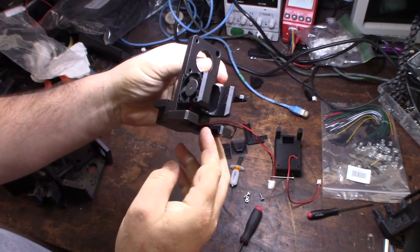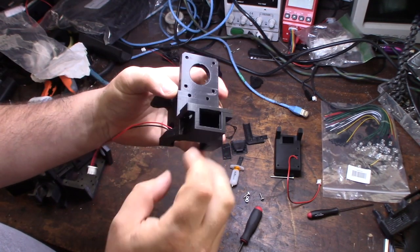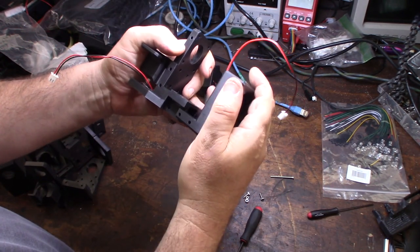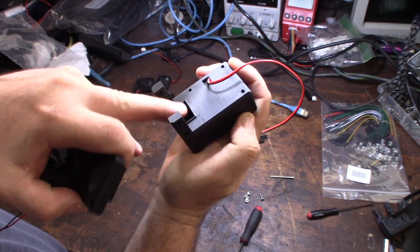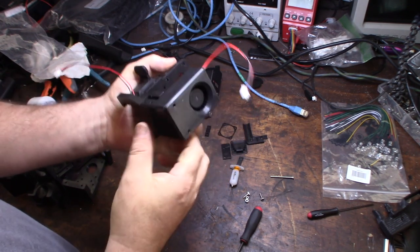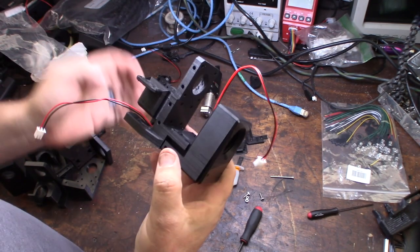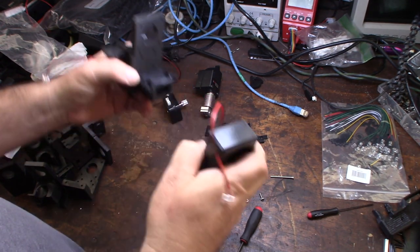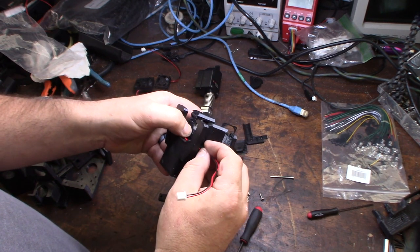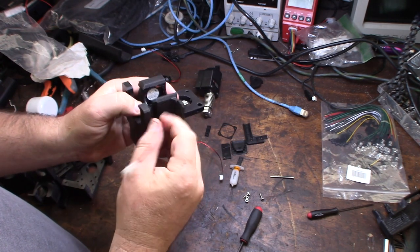Let me give you a closer look at the frame that connects everything together. On the back, the blower fan comes through the back and attaches here — there are lips that act like a seal. I'm using a 4020 blower fan, which I've used in a couple of designs now. I'll also create wire management below with a screw to hold the wire away from the hot end.